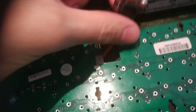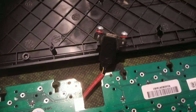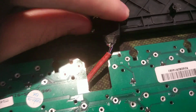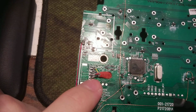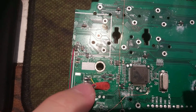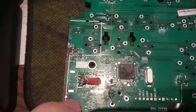Also, you have to pay attention. These extensions, they're not color coded right, or maybe they are, but this is a USB 3.0 or 3.1 connector, and it had all the other cables that I've cut. Alright, as you can see, black obviously is for the minus, then plus, and then it's not white and green, it's purple and yellow, in this order.